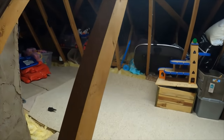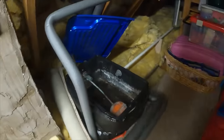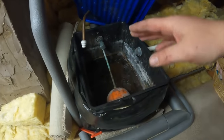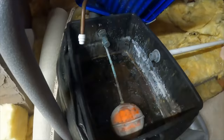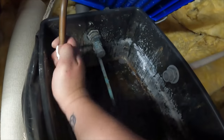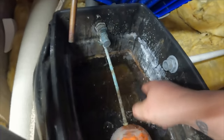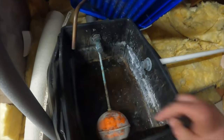The tank is still full of water. What this does is stop the tank dragging any air in - usually when you drain the system down completely it sucks all the water out of the header tank and can pull air in. Doing it this way stops any air locks occurring. Pop that one off, pop the bung out - it will pull a little bit in. Always check that the ball valves are working and shutting off.